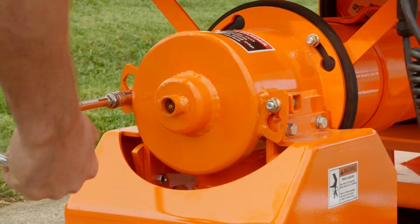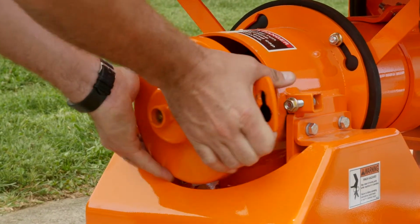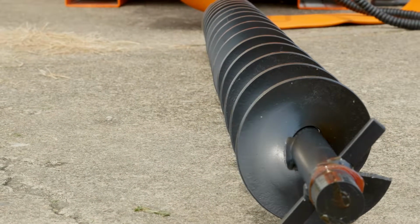What you have is a speed wrench. With this speed wrench, you have 2 nuts to loosen up. Once you loosen those, you twist the cap, pull the auger out, and you're able to hose down the auger as well as the hopper. Simply a 15-minute cleanup and you're back in action.